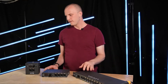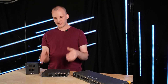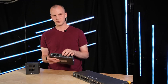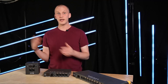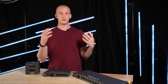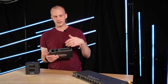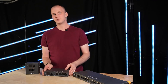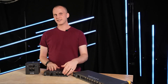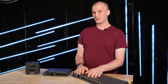We've used these in some really cool situations. We had someone recently using a wall station to send a DMX input into port four, which would then send DMX to ports one, two, and three. They were using LightKey, a Mac software, to run their lights, and also had a wall panel sending DMX to run scenes when LightKey wasn't active. You can bring it in as an input, broadcast it to merge, and use it as a backup. When the lighting software is up, the wall switch doesn't activate anything. When it's turned off, the incoming DMX is sent to those three ports and the wall switch works. The RDM10 has a lot of similar functionality as well.